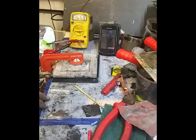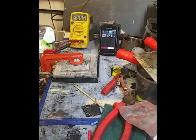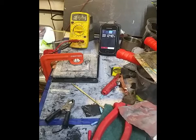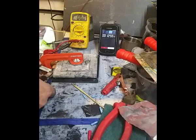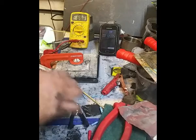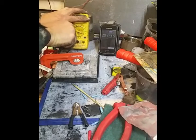9 minutes in — 166.9 milliamps. I'll go away and come back — 12 minutes 34 in — and disconnect that. Connect up the 0.1 ohm. On the wrong scale — back to the 10-amp scale. Camera just turned off. I've disconnected the 3 ohms and now at 13 minutes I'm connecting up the 0.1 ohm resistor.